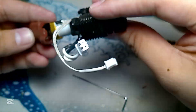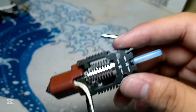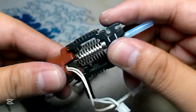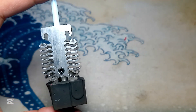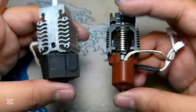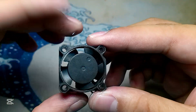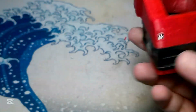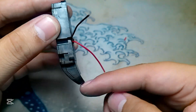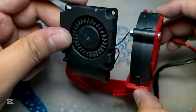Let's go ahead and assemble it already. As you can see, it is actually sturdy. Luckily I still have the old hot end for the extra screw — pretty sturdy. Now I'm going to show you the old hot end and the new one — size comparison. The other one's quite small but really powerful, great performance. This is the old fan connected to the hot end, and this is the 4020 fan that would be the replacement — very powerful, nice performance. This is the cooling fan for the nozzle itself, and this is the replacement 5015 one. The old one just has one outlet, the new one has two.